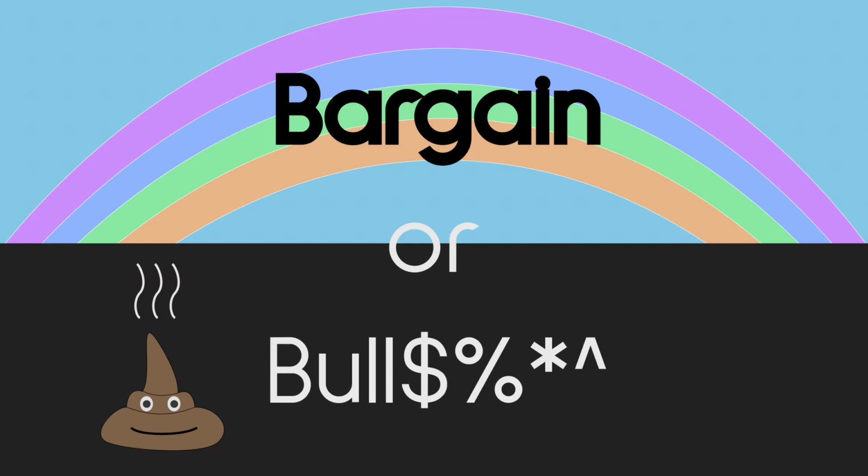But if you do need the quote-unquote 60 watts, you will see a lot of distortion. That's just what it ends up being. As we've discussed in the middle of this video, depending on 8 or 4 ohms, we'll go with 4 ohms because that's what they measured the 60 watts at, you're really looking closer to like 20 watts across the full range of frequency, because the power rating does change from low to high frequency. So in that respect, I would say it's kind of crappy to advertise the specifications that they advertise. And in that sense, I'm very not happy with them.